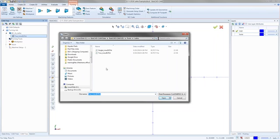So we went with some of our generic ones. You can still go online and find most post processors. All our OEMs are online, so you can go on there and find them. It's just BobCADsupport.com, which I think is where you guys sign up for this anyway. So on there's a downloads page that has post processors that you can go download if you don't have one already. If you do have one from a previous version, it should work, but it's definitely worth testing once.